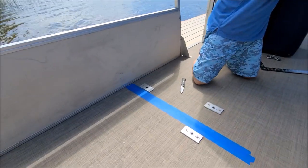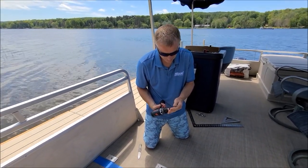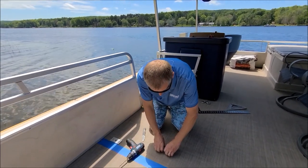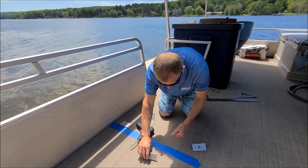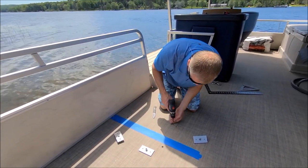Change the drill bit to a quarter-inch size. If you're confident the hole is lined up well, you can do a quarter inch, or step it up just slightly. The key is not to make it too big, so that the head of the screw doesn't go down into the hole.